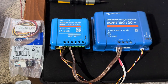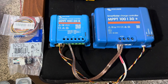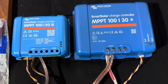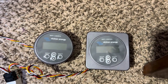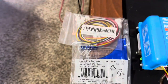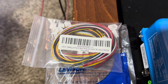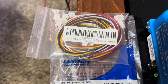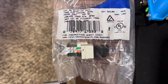I've got a different way of running my VE direct cables from my MPPT solar charge controllers to the MPPT control displays. I bought some ready-made pigtails, the JST PH 2.0, these are about 12 inches long, 300 millimeters, and I had a bunch of these punched-down Ethernet jacks.